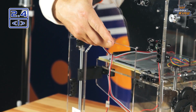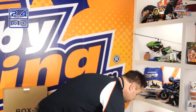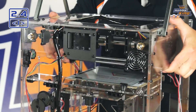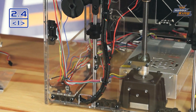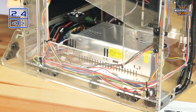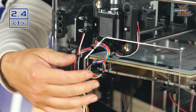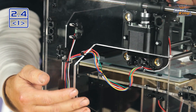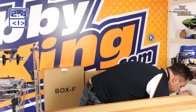Let me hold up a finished printer so you can get an idea of what it's supposed to look like. From the back you can see the zip tie holes, the external loom wire coming down here — there's a little chamfer — and two sets of wires coming along here up to the front control panel. There are provisions for the wiring harness that allow a little bit of slack so as these move back and forth the wires don't get bound up.